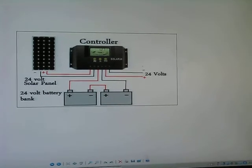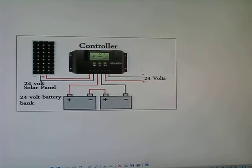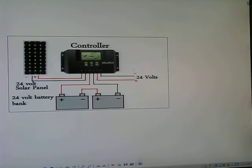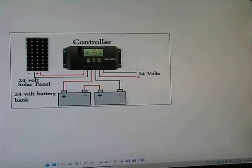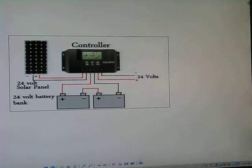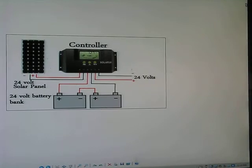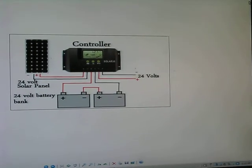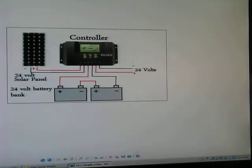This particular image is actually 24 volt. The same sort of setup can be done in 12 volt — that just means you've got a 12 volt panel and you've only got one 12 volt battery, or a couple of 12 volt batteries hooked in series. This sort of system at 24 volts with maybe two panels, that controller, and two batteries — you'd probably buy for about $1,000 bargain basement to $1,500.